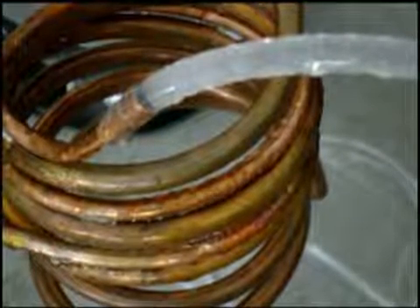It's been about 15 minutes and it's dripping very lightly — not much of a stream. But you can see that condensation building up that I was talking about. That's what really keeps those pipes cool and allows the gases and steam to condense down into a liquid. I'm going to come back in about five more minutes and we'll probably have a nice stream. Drip, drip, drip — it's chugging away there. You can see I have a nice little reserve of ethanol going. I'm going to let this run probably for about an hour and we'll have a good deal of ethanol.